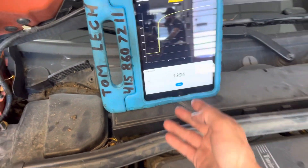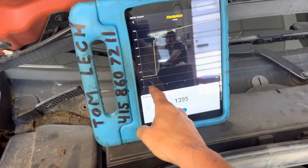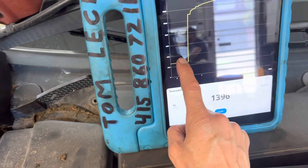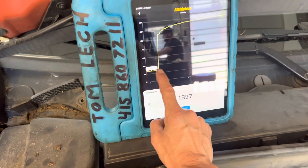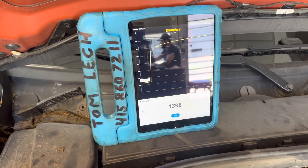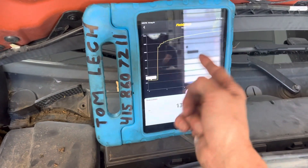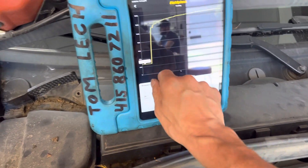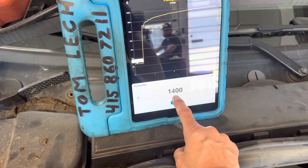I had to restart because I lost connection — I was up to the 45 minute mark. I'm going into an hour now. I got down to 200 and 266 microns and I shut it off at about the 45 minute mark. I lost contact, had to restart and reconnect, so I started again and then I shut it off for you guys — and you can see where it's going up to about 1400 microns.